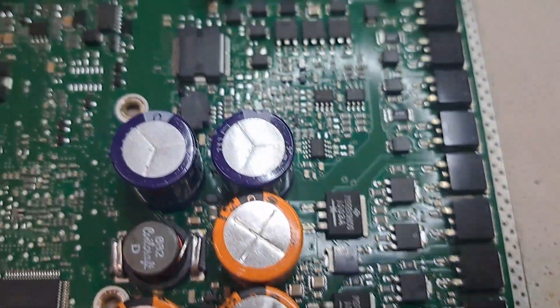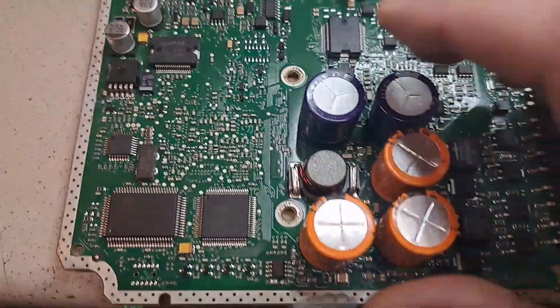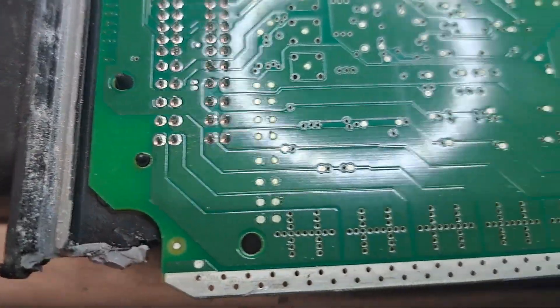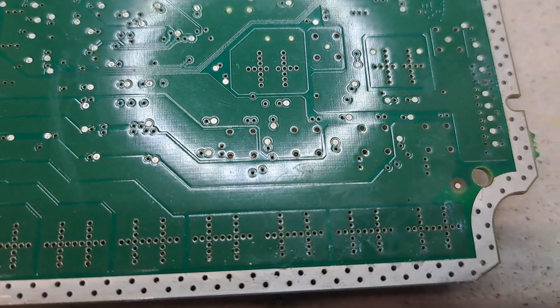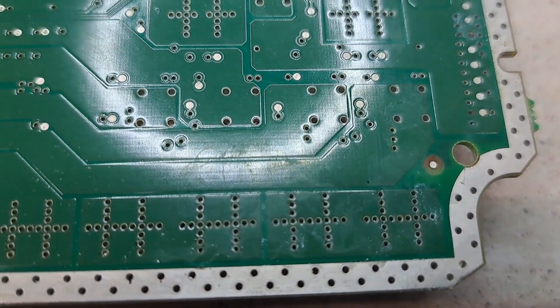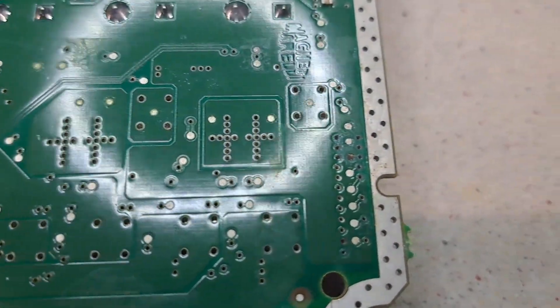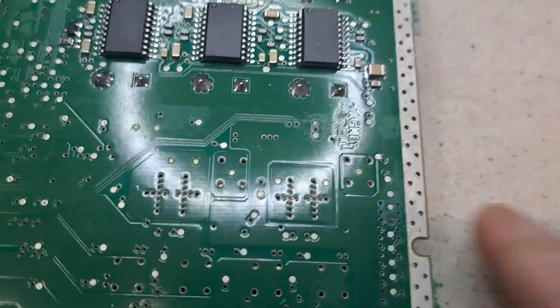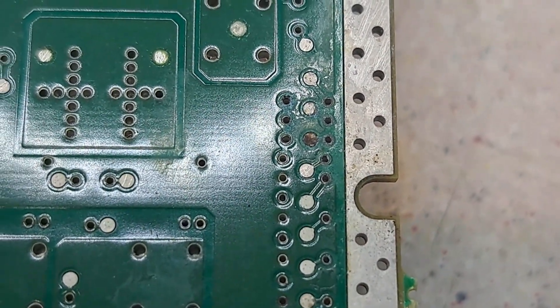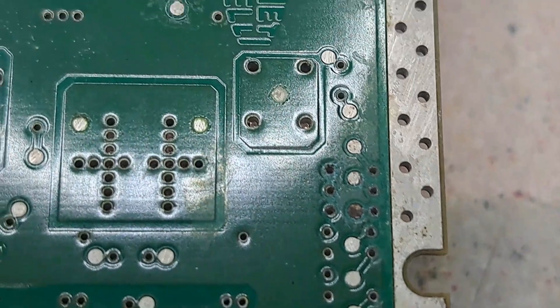Other than that it's not too bad. There is water damage on the opposite side of the board as well, but I've cleaned around that and it doesn't look too bad. There's pad damage here around the heat sink area — that could be problematic, so I'll check that.